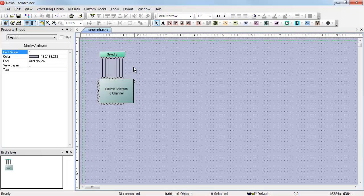That's all you have to do to program the Select8 to control that source selector. When you rotate the control on the front of the Select8 to position 5 and press in on the knob, it will select source 5. Rotate back to position 2, press in on the knob, and the source selector will change to source 2.